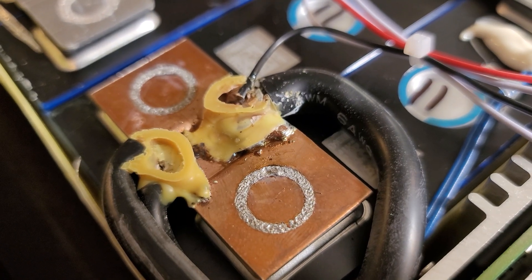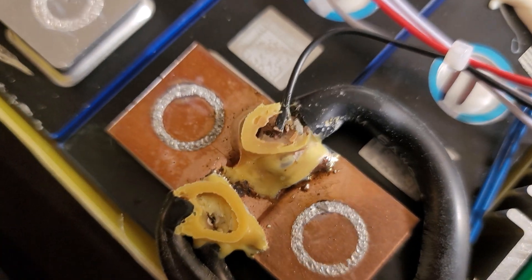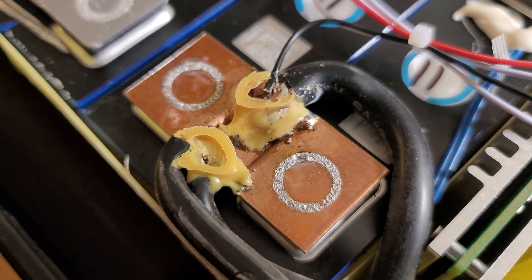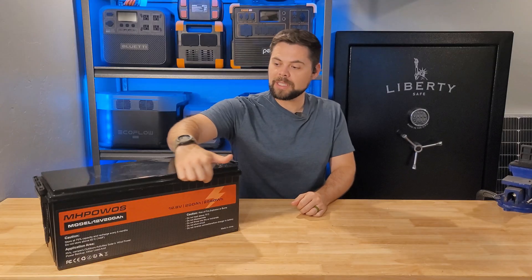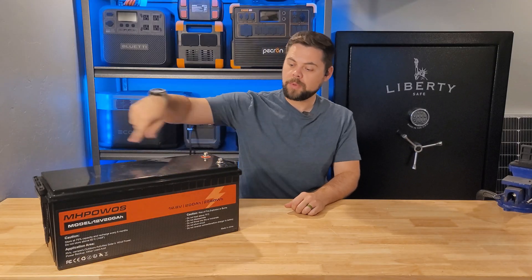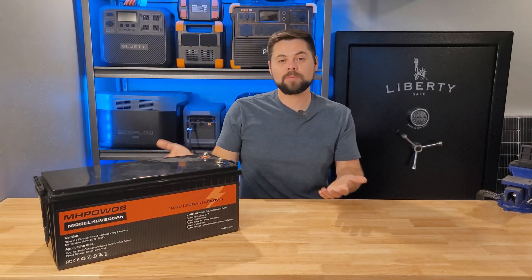I also didn't like how the main battery cables were soldered to the batteries — it just looked very poor quality and was gobbed on with some insulating glue. It just didn't look very professional. To put this all back together, I simply re-taped everything, cleaned out all of the old glue, put in new silicone glue along the inside of the lid, put it on, and clamped it shut. Now it's looking like it's brand new again. Getting into the battery is pretty easy — replacing cells, not really.